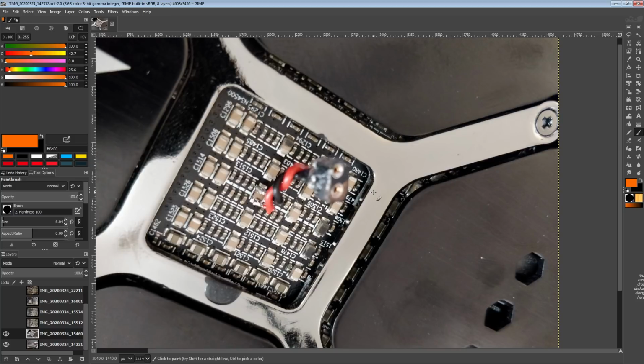So yeah, that's another issue. That's basically why, behind the core, you should be getting almost exactly the same voltage as if you were measuring die-sense, but I'm measuring like 20 millivolts off. It's because I'm using a passive probe, and I can't float the system because I've tried that and it really doesn't work at all.